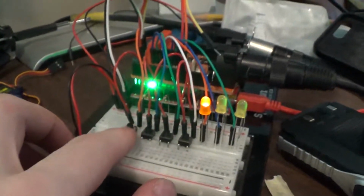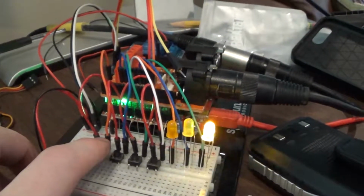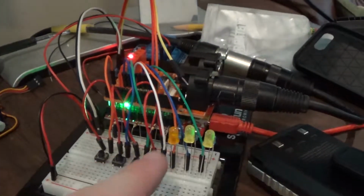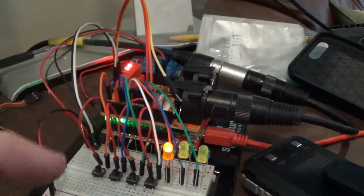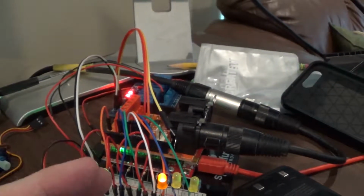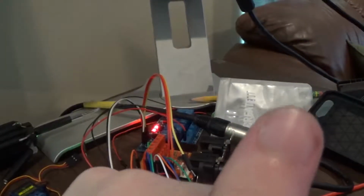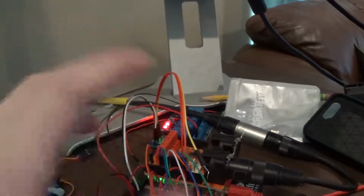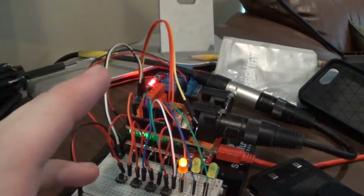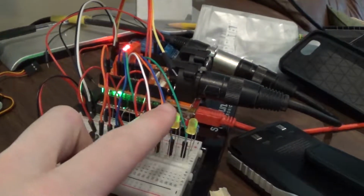So if we go ahead and power this up, we press and hold the power / reset button, and you can see it lights up the LEDs. Once they're all lit up, you've held it for long enough to turn it on. Then both relays turn on. I've got 2 on there right now, because in theory I could have 2 separate power lines going up to the batten, so I could turn on half the fixtures at a time, so that it's not as huge of an inrush current. Just a little planning right there.